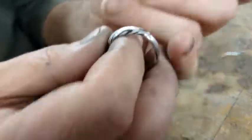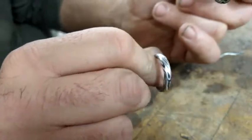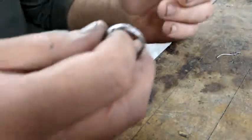That'll be fine though. The pattern has just not really been applied. It's been hit just so I can see what's going on. And we're going to basically take it off here again and reapply it. So, first round of sanding, 1,000 grit. Wet sand, here we go.